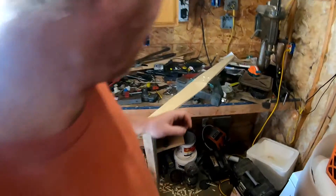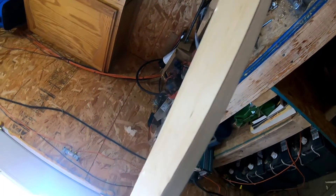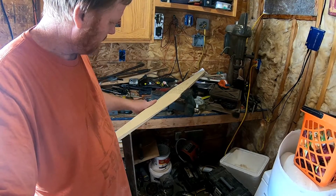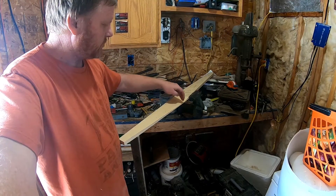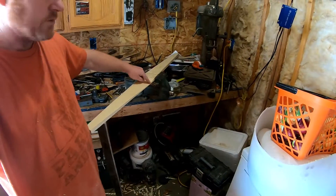Hopefully you can see what I've done there — we started out thinning here, we're right to the line, and now it's thick. So far we've just gone straight lines. We made the straight line, cut the taper, then went corner to corner in a straight line. I don't usually go all the way up against this corner because I'm going to wind up rounding it slightly to make the airfoil. This end is at a greater angle because it's going to be traveling less distance than the tip. The tip has to travel a greater circumference distance than the root of the blade.